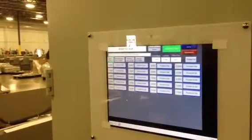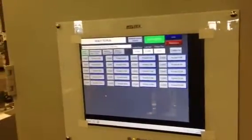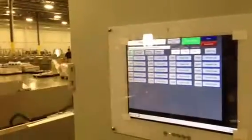What's going to happen is every time a book trips the trailing edge of a photocell in the loader, in the pocket right there, I don't know if you can see it or not, it's going to call that a P and put it in the register right here. And then the system's going to track it down to the caliper. So, for example, if I was to take a book on the line and trip the trailing edge here, it stuck a 1 in the register, because that is pocket 1.